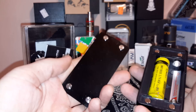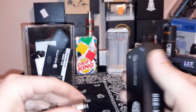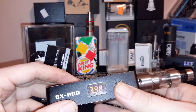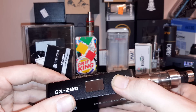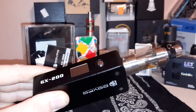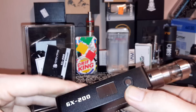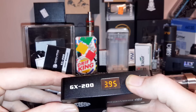Here's the back of the door — you can see those magnets pressed straight into the cover. Probably my favorite feature of the whole deal is that while you're vaping you can monitor your active voltage drop. I never push my battery below three volts per cell — that's a rule of thumb to help them last longer and perform better. So I was seeing 3.98 volts, and now I fired it — I'm thinking 4.2 is a full charge, but I got a pretty big build on here. I'm running triple twisted flat wire — actually four pieces of wire all twisted together — and it's absolutely great for flavor.